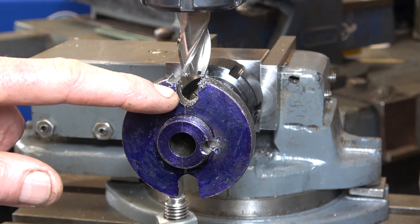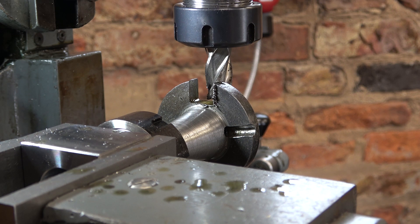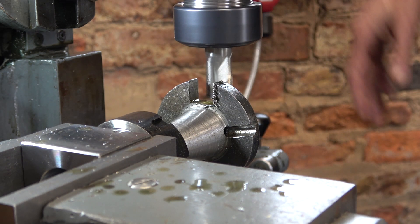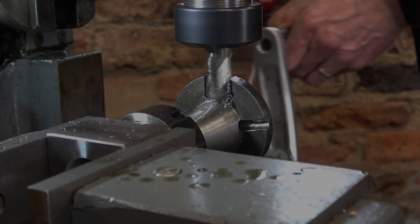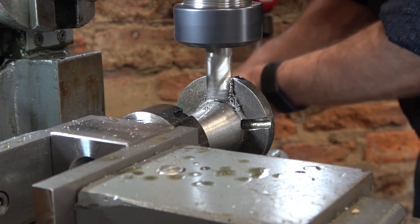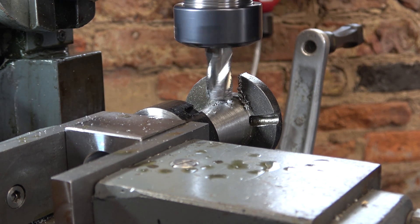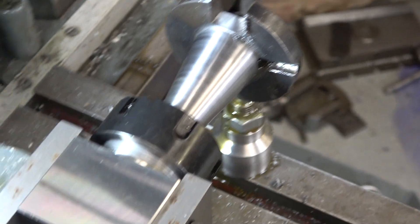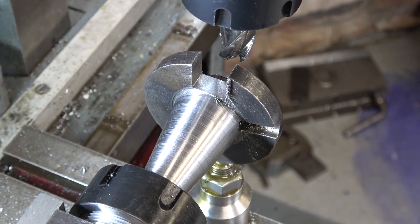This is definitely working. I'm taking half-a-millimetre cuts without much complaint — it's just going to take a while. This might be the last cut. I've been taking 0.4mm cuts; I found it was better to take lighter cuts because I could work more quickly that way, and it's quite difficult to turn the handle and make it smooth. Measurement time — I think it's done. That side is finished, so I've got to turn it over in the block and flip it to do the other side. Took about 20 minutes.